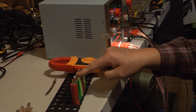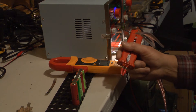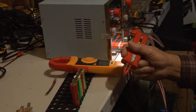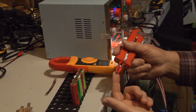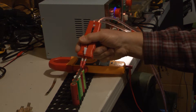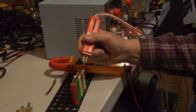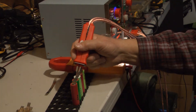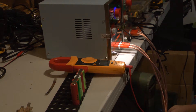Four pulses is all you need — only spot weld one at a time. One other tip: when I was spot welding I put tape around here to separate the electrodes, because they would start touching. There's a spring in there that got so hot I had to put a paper wedge in to keep them apart. Keeping them apart lets the current go through the nickel, down under the battery, and back up. You can see this one hasn't been hot and they're spread apart perfectly.